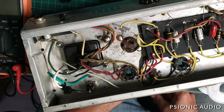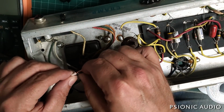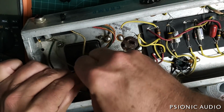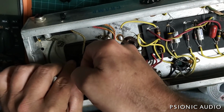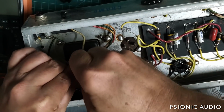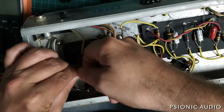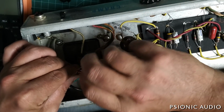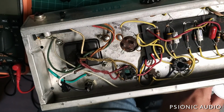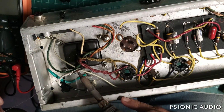And it's very hard to do a good lineman's splice or NASA splice on these wires. It's doable, but it's a lot of work, and I only have a short amount of original primary exposed on that power transformer. I'd rather not have one shot at it, because those are difficult splices to do with a wire of this diameter. So I just do that wrap around each other and then solder them together.